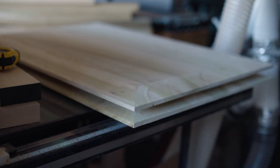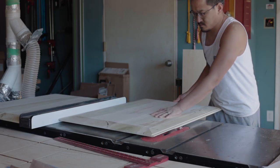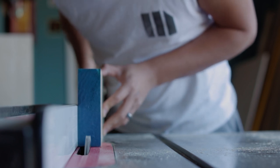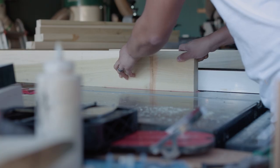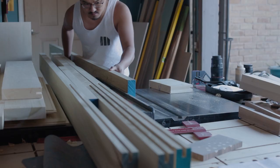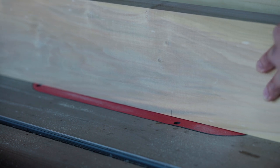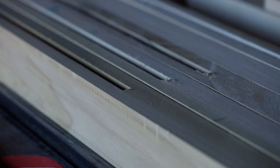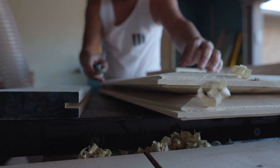I left some extra material on the edge of the panel so I could come back with my dado stack and trim it down to fit into the grooves on my rails and stiles. The panel itself will be free-floating inside the groove, which is typical for a raised panel door. I'll go ahead and create the grooves on my rails and stiles as well — for the stiles, I'll stop the grooves short since the glass panels won't be installed in those grooves. I used a block plane to shave down the tongue just a little bit since they were tight, and cleaned up the burn marks as well.